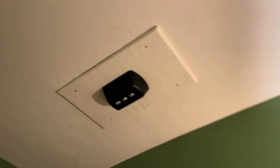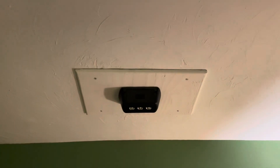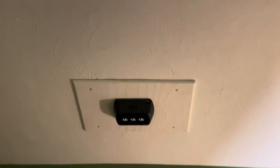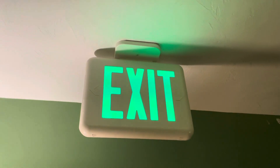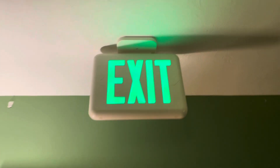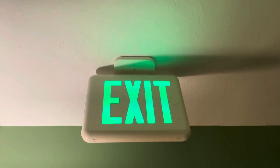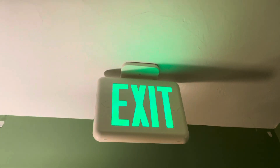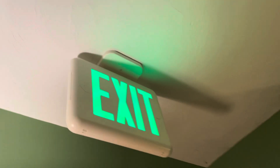If we go into this room, I have another one of those units except in black housing. This one is on an access panel on the ceiling — I just replaced this access panel to make it look nice, routed the edges and everything; the old one was just made of fiberboard and looked terrible. Over here I have a dual light ELSS exit sign, part of the dual light Evolution series. This isn't a self-contained unit — it's powered by the inverter and goes into emergency mode when the inverter does. It's just one pair of wires going to this sign running back to the inverter.